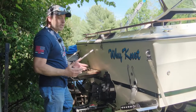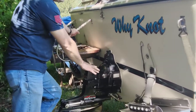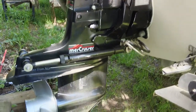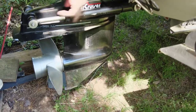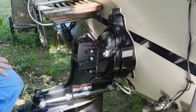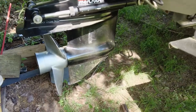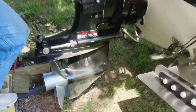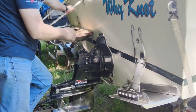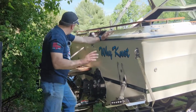We're going to start at the back of the boat. From the get-go when we got it, we took this whole thing off and redid it. You can see it's all painted, new stickers. We put new pumps and impellers, the ram seals, stainless steel braided hoses, new limiting pucks on the side - all this has been redone. We even did the prop. New anode on here, and just recently last year we took the gimbal ring off, sealed everything up, changed a few things. This has totally been redone.